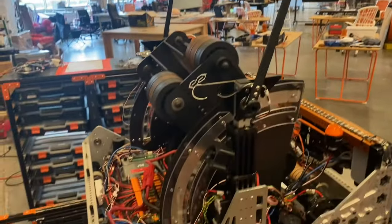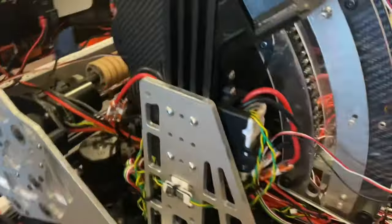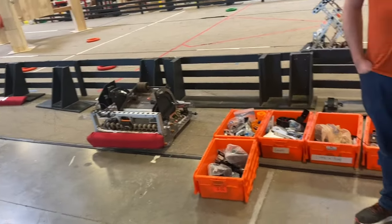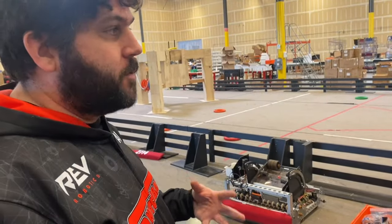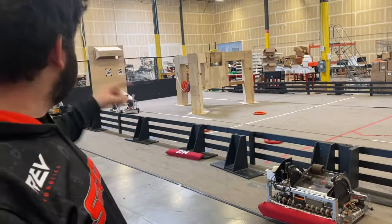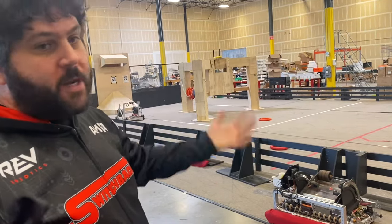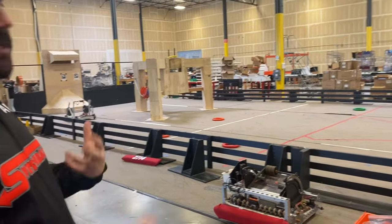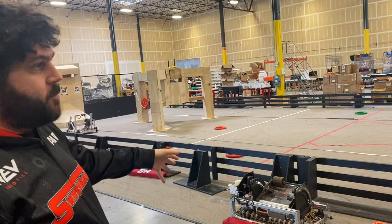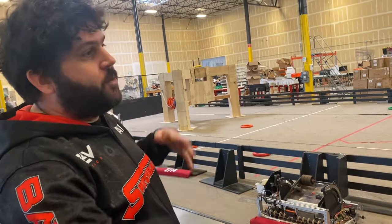So the team builds two robots, one as a development platform to learn, and once they get that one up and running, then we do the other one as a competition robot. And now you bring the development one back up, and you can see that one's rougher around the edges than this one. But because programming is such a huge part of the FIRST Robotics Competition, we have an autonomous period. That robot can navigate around the field autonomously. We use the AprilTags to do a pose so the robot knows where it is on the field. It automatically moves its shooter. It automatically does pickup and ranges. It's got a whole state machine inside of it for indexing the rings. And so we have the programming students working on the one robot while the other one is being tweaked. And then generally the drive team practices driving one, and they trade off between programmers and practice driving when we're at this point in the season.